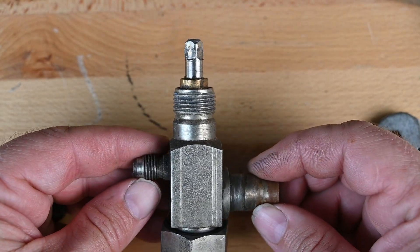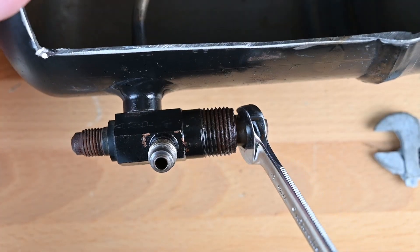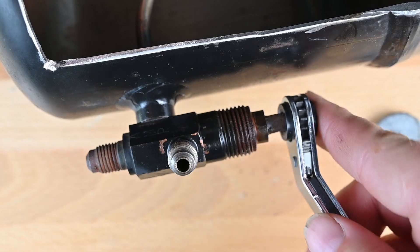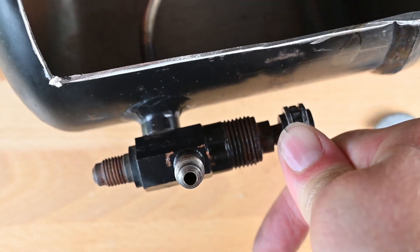If you have these three-way service valves also on king valves, you'll see these points right here where we put the same tool in. I can loosen this — this one's been rusted so it's a little tight — then I can use my service wrench on it and midseat it.